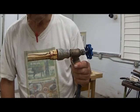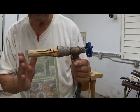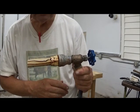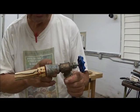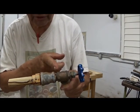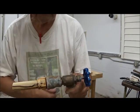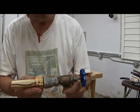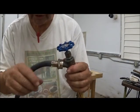So what I did was cut the water off to the house, take a hacksaw, and cut off this PVC pipe. Now I'm going to replace this section that you can hardly see, which is a connection between these two, and put a new valve on it. Well, that's what we're about. And the washing machine hose, of course, fits here.